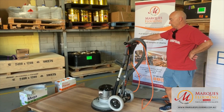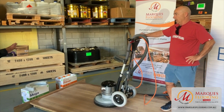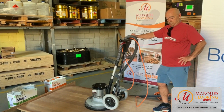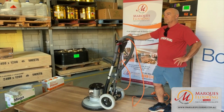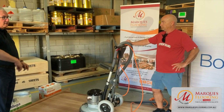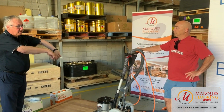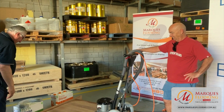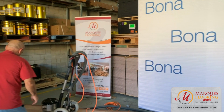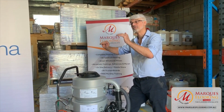I believe that, but I was just seeing how we go across the grain as well. You can see that control-wise, it's nice and easy. You can use it any direction, any combination. It doesn't matter if you're going that way or that way, they're still going across the grain. It doesn't change the area. The trick is not to swing it. If you swing it, you'll put marks in it. You're moving too quick and you start to unbalance the four heads.